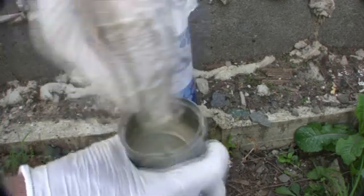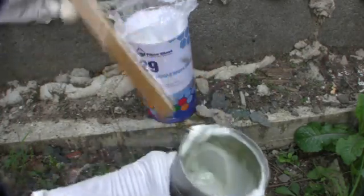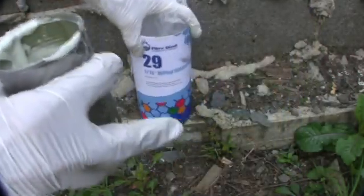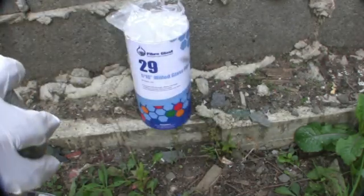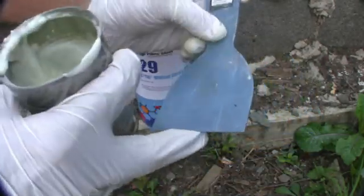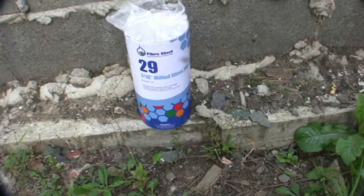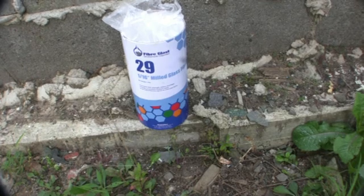I wanted the 1/16" milled glass because it's got to be stronger than the smaller milled glass. You can actually see this 1/16" milled glass on there - it does fair pretty good. These are the knives I use: a real steel one that I clean off on the board first, not on the steel, and a rag. Then I use these Harbor Freight putty knives - you can get a whole set for like 99 cents. They're a lot stiffer than those yellow squeegee things, which are crap - they don't even come from the factory flat.